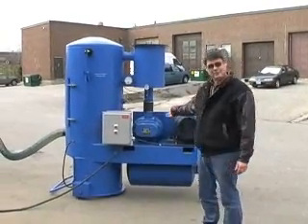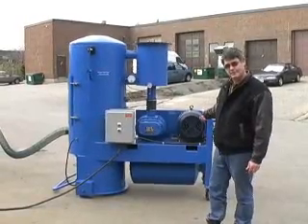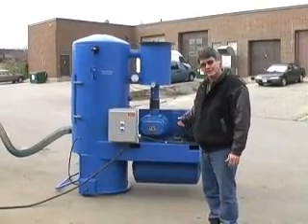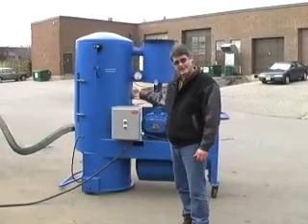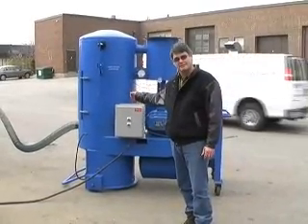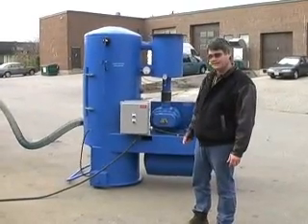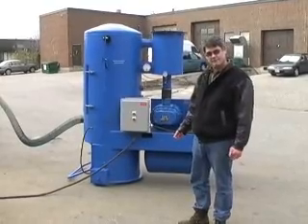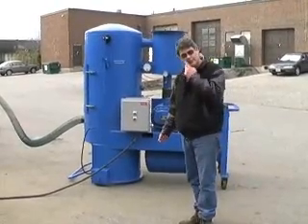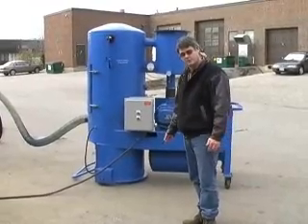What we have for our test is a 25 horsepower machine. This is electric driven, but your conventional machine we want to put a gasoline or diesel engine on. This particular machine has a bag house that you don't necessarily need because yours is wet and not dry. This machine will do 600 CFM at 14 inches of mercury, which is more than enough to power a 3 inch, 100 foot or 200 foot long hose with water.